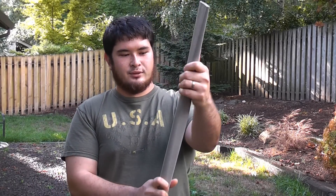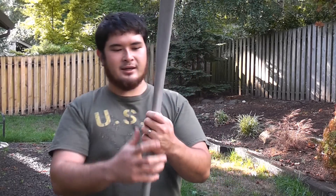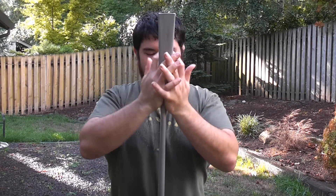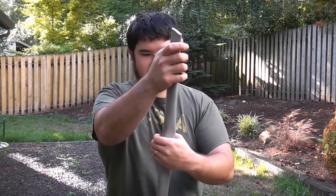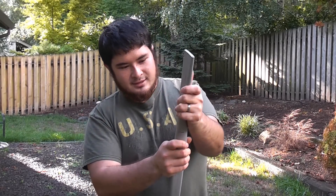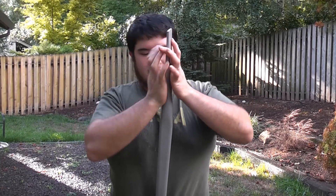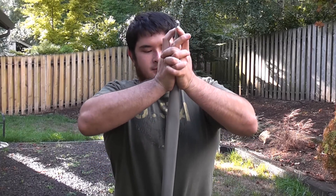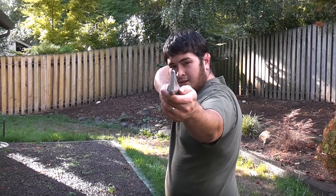Okay, so you can see everything's sort of coming back. Now you want to do a couple things. You want to kind of smush the bottom to bring it back so you have a nice transition here, but you don't want to get it too thick right in this section — so it's going to take a little bit of pressing. Be careful, this is very hot — you're going to need some kind of hand protection. And then this top portion here, you want to sight down and make sure it's lining up with everything. You're going to need to press it back to center because it was formed off center. It takes a little practice. Just form it while you can still form it.